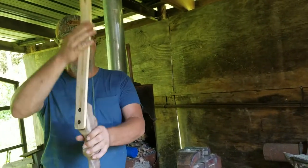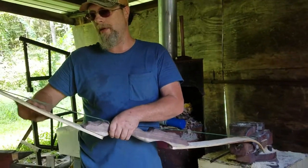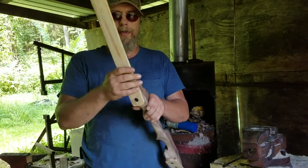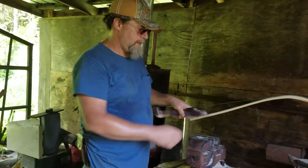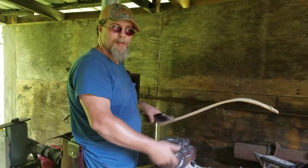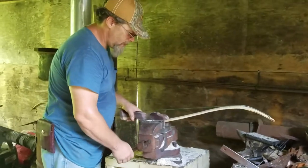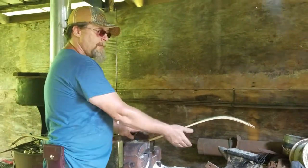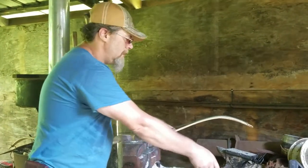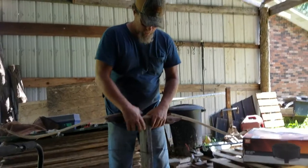This is the back. This is where you put the backing at, on the front of the bow. I want to take it out on the inside part of the limbs, so I don't want to take it off here and it possibly cause it to splinter and have one raise and break. And I'm going to put some kind of backing on the front of it. Now look, tiller it again.